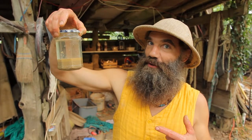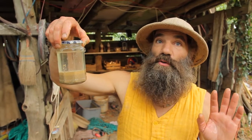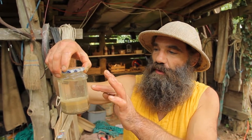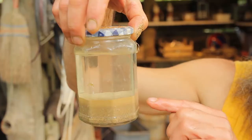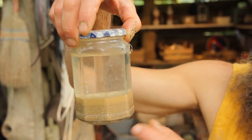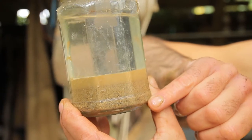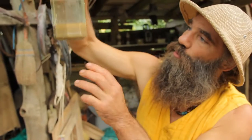So when you pick up your clay from the ground, you want to make sure there are the proportions you need. You put it in a jar like this with water, then you shake it, and after a while — after a night, for example — all the sand, which is heavier, is going to be at the bottom. And after that, the clay, which has this peculiar color, so we can clearly say that we have 25 percent of clay in this mix, and the rest is clearly some sand, and there may be some little gravels there but we won't see them.